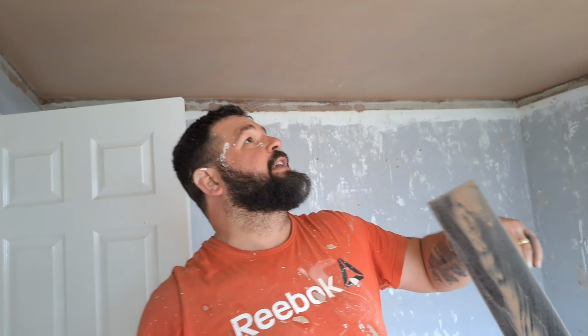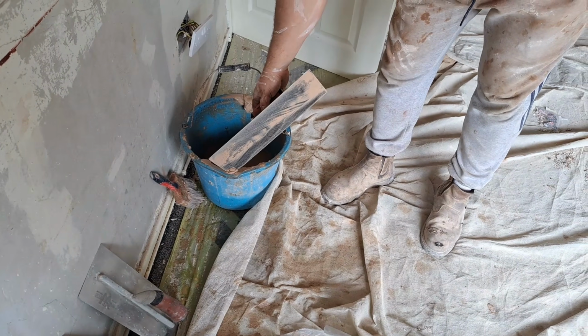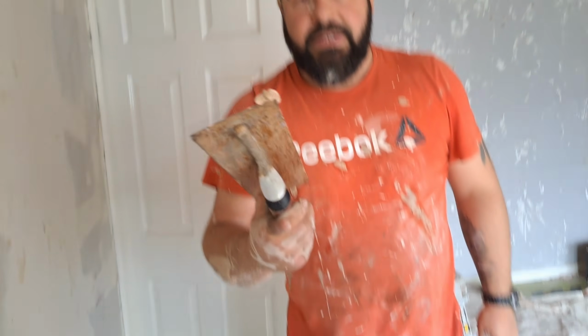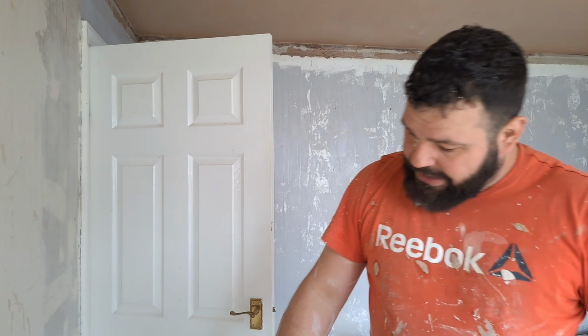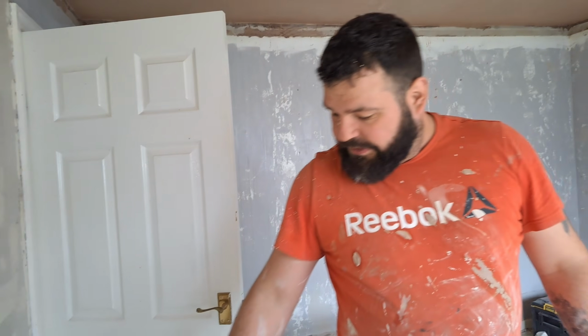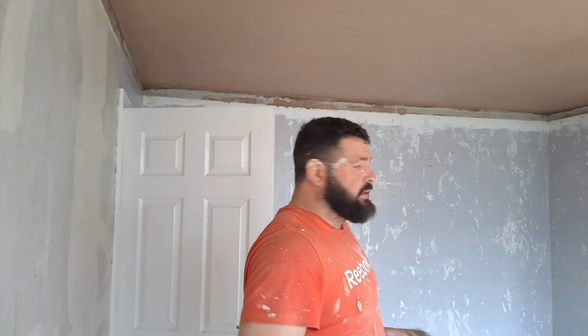He'll carry a plasterboard in and stand it up and jab the corner of the board into the ceiling. Great, now we've got a hole in the ceiling. I will use this stuff from the first flattening in to fill it. Yeah, that's why I leave it on the side of the bucket. As you start troweling up, the fat that comes off gets more and more diluted. It's weak, it just doesn't set, it's like dusty, so you can't use that.